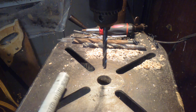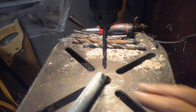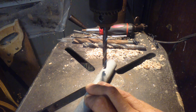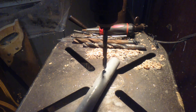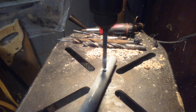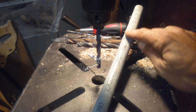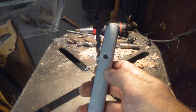We're going to start by drilling our holes here in the wood shop using a drill press. Since I've already drilled my PVC pieces, I'll use this piece as a demonstration. I recommend using something a little bigger, but this will work. Use either a 5/16ths or an 11/32nds drill bit and bore a hole in just one side of the pipe. One trick: if your pipe has writing on it, use that writing as a guide to drill your holes in a nice straight line.